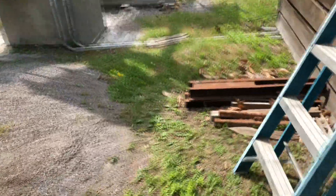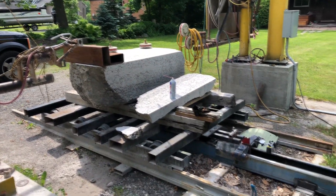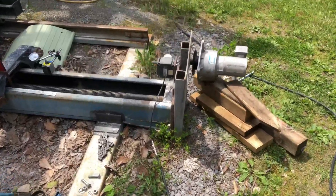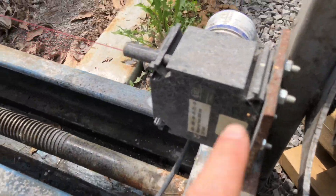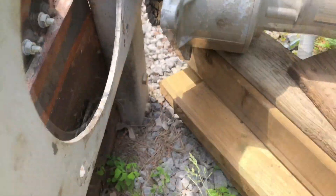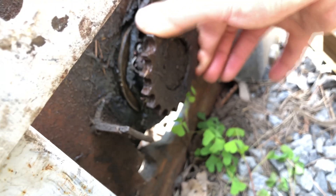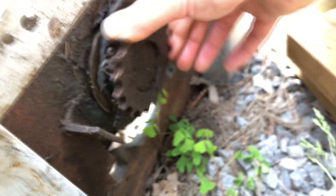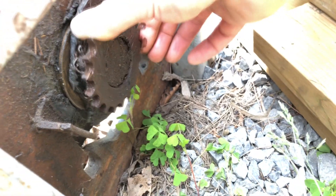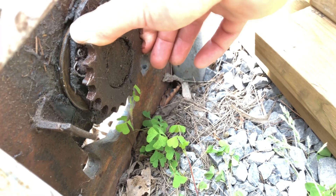I'll go out to the axis and take a look at what I just found. So that's the x-axis. That's the draw wire encoder. You can see it hooked up there. I've just taken the motor off. And there's the gear. Just watch — I think I've got a bit of backlash, or at least I found one source of it. That's just the gear how it connects onto the shaft, so I'm going to have to do something to pin that better, because that's a lot of slop.